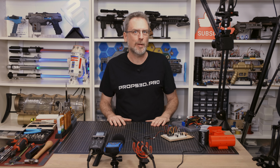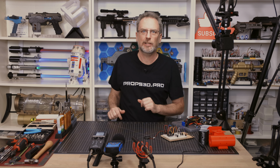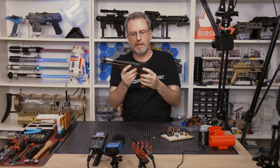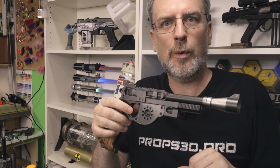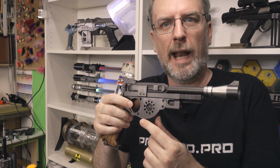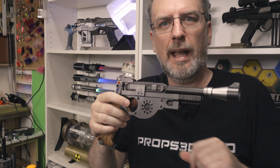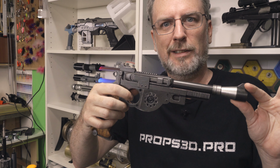A problem I'm hoping we can solve together over the next few videos, and that problem is audio in props. Check this out. This is my as yet unreleased Mandalorian blaster. It has what I consider my basic audio setup, which is a 2.5 watt amp, a 2 watt 40mm speaker, and a DF Player Mini MP3 player. And it sounds like this.